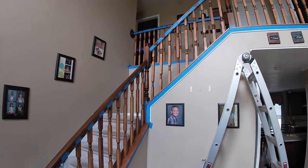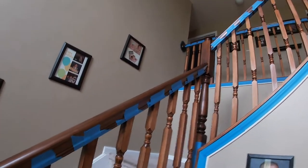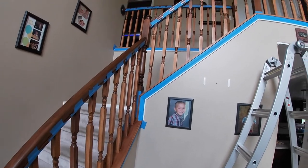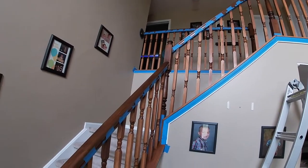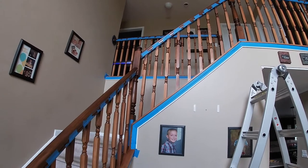And a week later, this is what we have. I already taped up what I needed to get these spindles painted. As you can see, we are a lot darker now - this will give you an idea of what we were versus what we are now. Pretty big difference. We do still have to put some polyurethane on here. I decided to go ahead with the white paint first and then go back with the polyurethane, because we don't really have to touch the bottom of the rail with the polyurethane. Each staining coat took eight to twelve hours to dry, so with schedules it took about a week to get to this point.